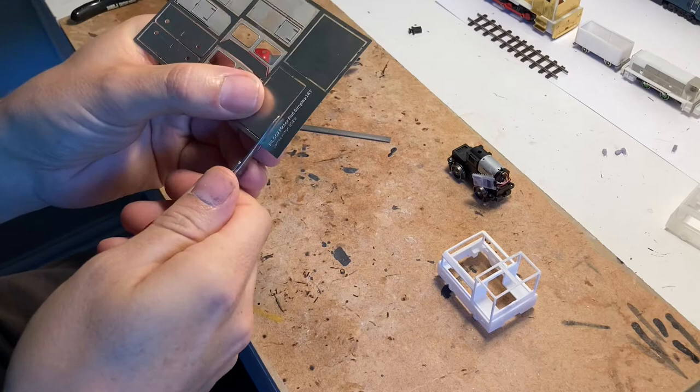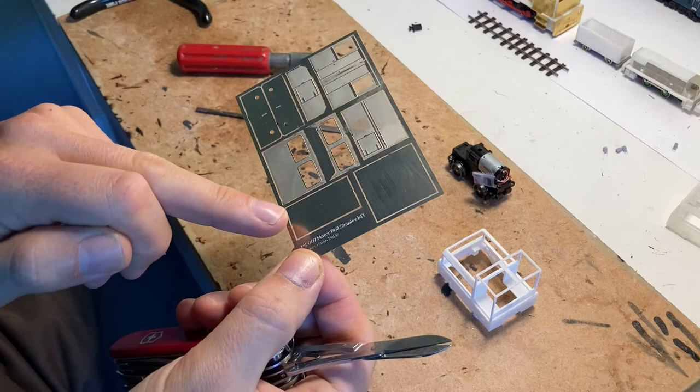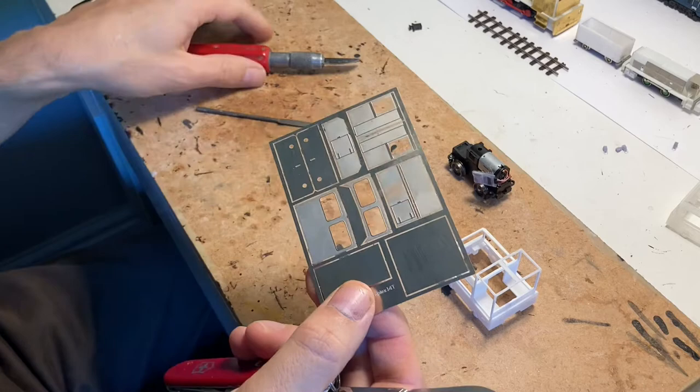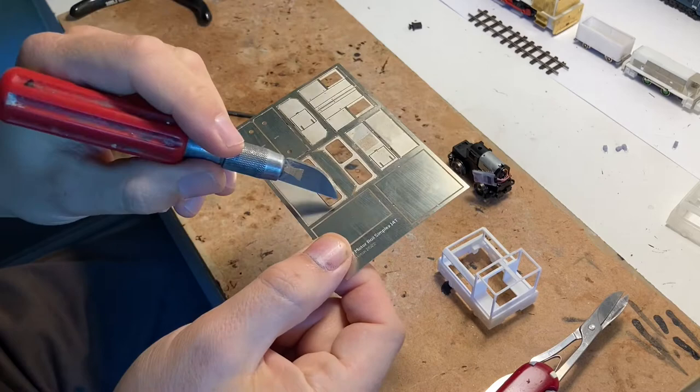And that works really well for pieces that are full etched. But what you can find with using a snips like this is that you can bend the edge. So what I recommend is, if you've got a half etched surface, use a blade. And rather than using a cutting mat, I find if you use a cutting mat, what can happen is, as you cut down, because the cutting mat's soft, the metal deforms into that, and so you'll curve the edge of that etch.